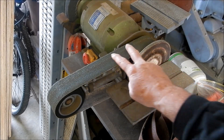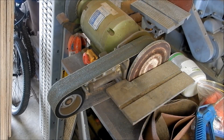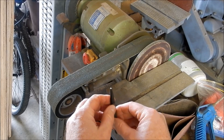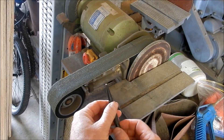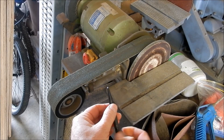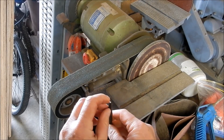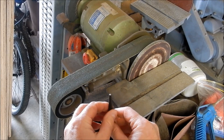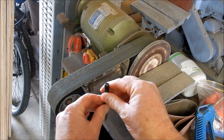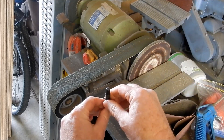Just out here with the belt sander or belt grinder — a little trick I learnt years ago when grinding up centre punches. If you try and do this by hand against the grinder, you'll have a dwell period and you'll end up with little flats, and the point isn't going to be exactly central. Which makes it hard when you're trying to centre up fairly accurately to get a pop mark put in.